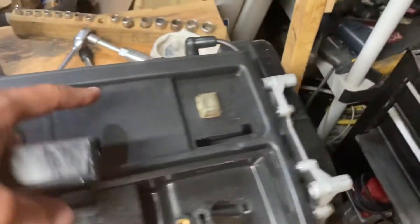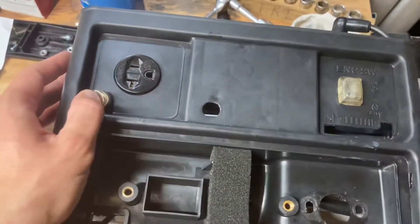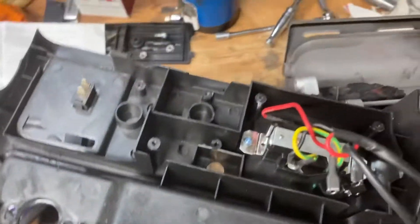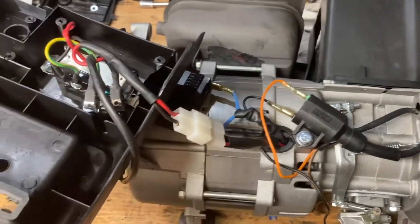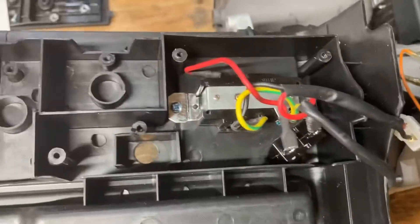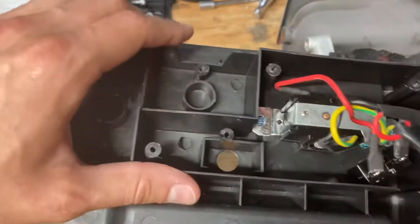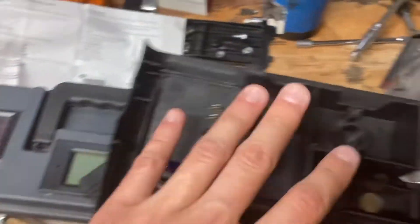You can see I carved out - there's plenty of space in the front here. What I did was I moved the overcurrent reset button, that's why there's this hole here, and on the back there are some mounting features. I already moved the capacitor which normally sits up here - I have it in a place where I can velcro it to the bottom of the gas tank. So first thing will be to clear out some of this structure here so I have a flat surface, then I can trace the meter and cut a hole with the Dremel to sink it in.